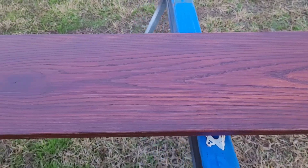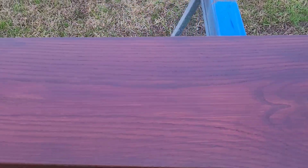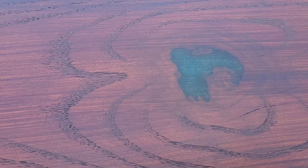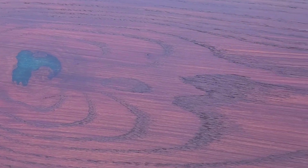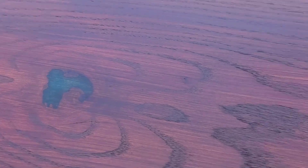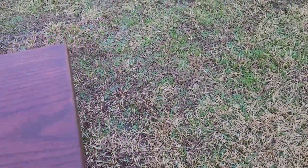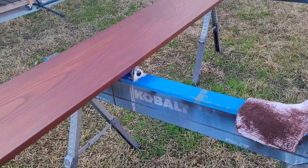This is my last board that I was staining — I'm using a black cherry stain by General Finish. This is the part where I had to fill in the board with epoxy. It was the third try; I don't know if the epoxy I have is bad. So I'm going to let that dry, flip it over, and give the other side a stain, then it'll be ready for me to shoot it.